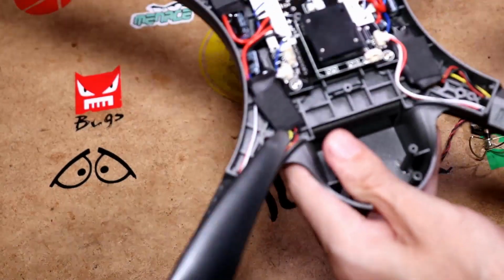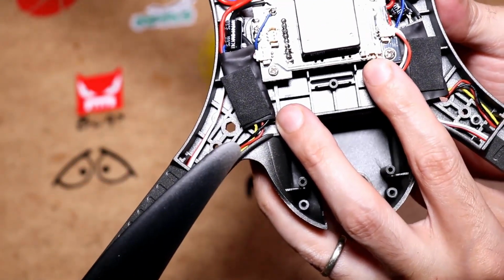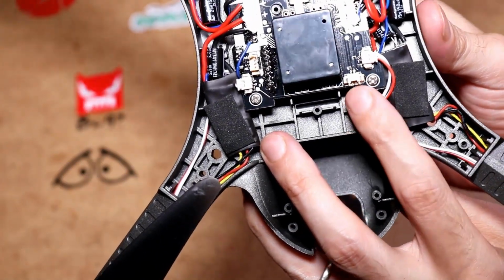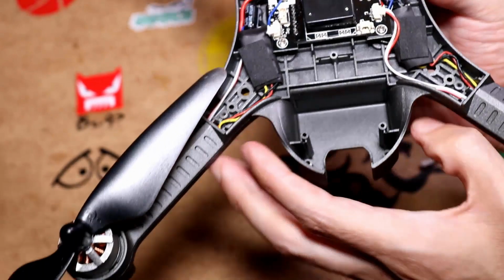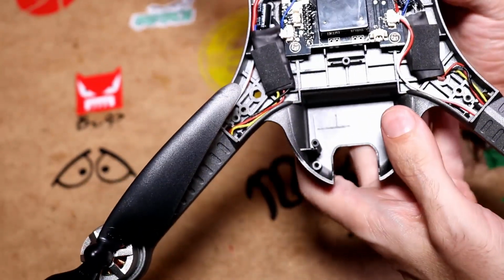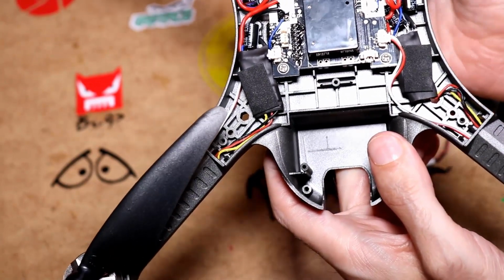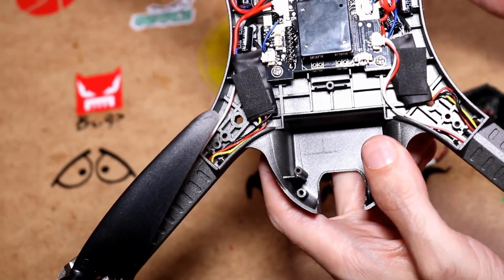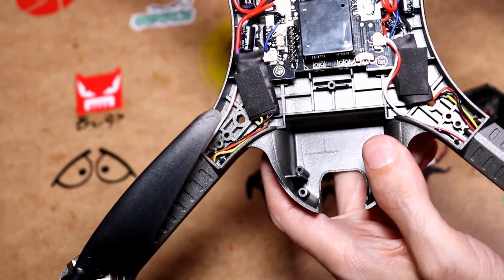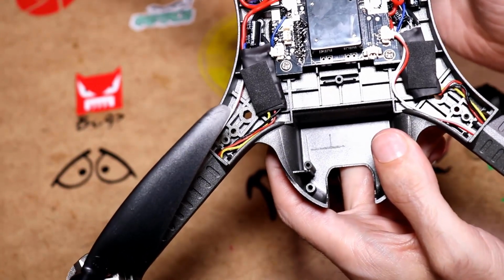side. Now, where you've taken the LED light from right here gives you the exact voltage that is coming from your main battery. So you could therefore plug in a VTX or anything else. Anything else, remember it's a two cell battery that's running. So your max voltage at the start will be 8.40 and it will keep dropping as the battery is dropping itself. Bear that in mind.